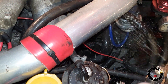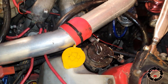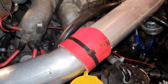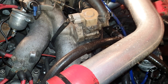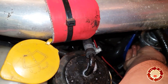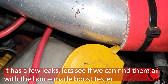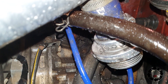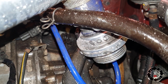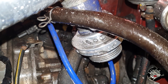Another possible suspect is the dump valve itself, so we're just going to fill the dump valve up with water, pressurize it again and then have a look. Yeah there, yeah, yeah right. There's the culprit — the dump valve itself. It's the dump valve — the dump valve is leaking.